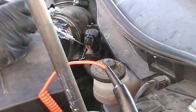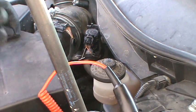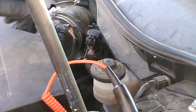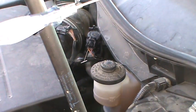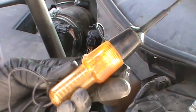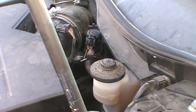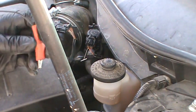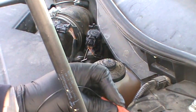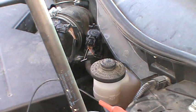If I get a straight wire and touch it right now, you'll hear it click. But because this doesn't flow a lot of electricity, this is an LED test light, so I don't hear any type of clicking noise with it. But I got this other type which is just an incandescent, so it's going to flow a little bit more electricity. That's why they call those LEDs computer safe — because even if you hook up something wrong, you're not going to blow the computer.